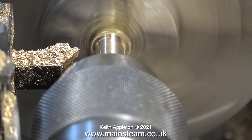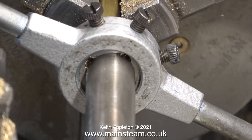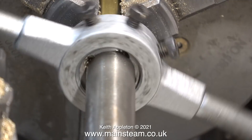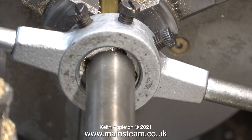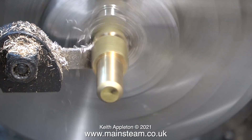Here I'm using one of my cheap and cheerful threading adapters — maybe it's not quite as good as a tailstock die holder but it's a lot cheaper, and I can have every one of them pre-loaded with dies which saves a lot of time. The piece of bar I would normally use for the tailstock die holder is fitted in the tailstock quill, and by carefully following the speed of the cut with the hand wheel on the tailstock you can get a very accurate thread. Here's the thread fitted with a union nut and a union cone.